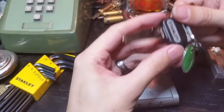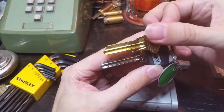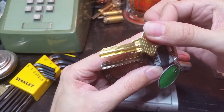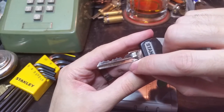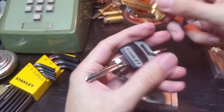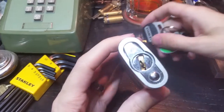These keys are worth a little bit of a look. They look kind of funky at first glance, but really they are just modified versions of the SC4 — the standard six-pin Schlage blank. It's just that this little notch has been cut away where there would normally be an extra tab here, and that's to fit past that very thick faceplate and anti-drill plate.